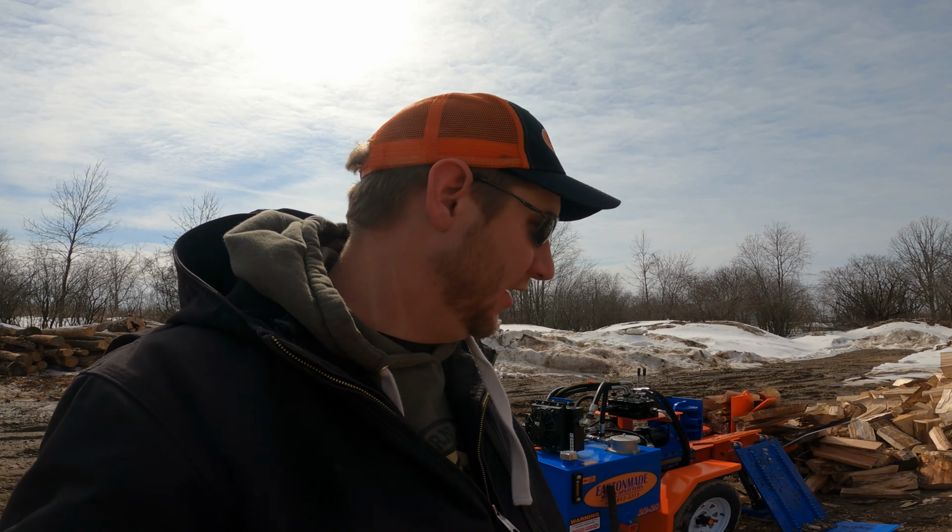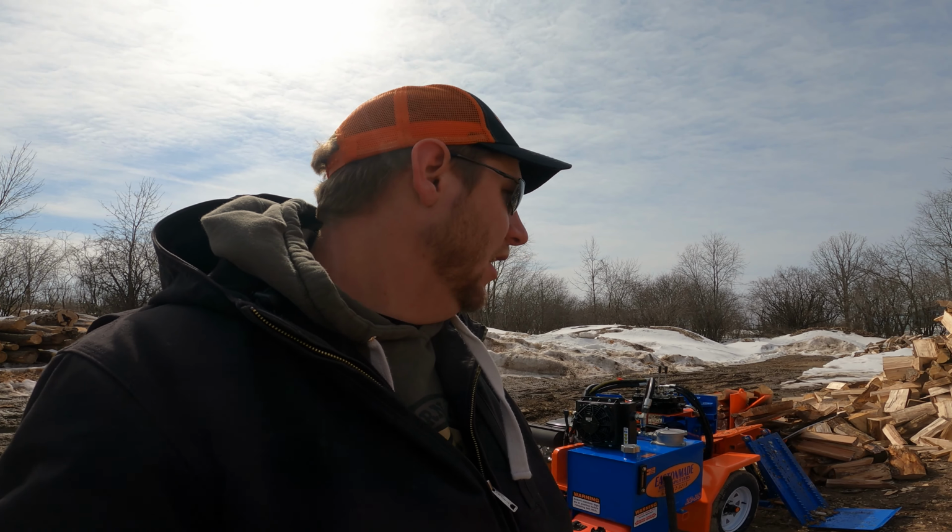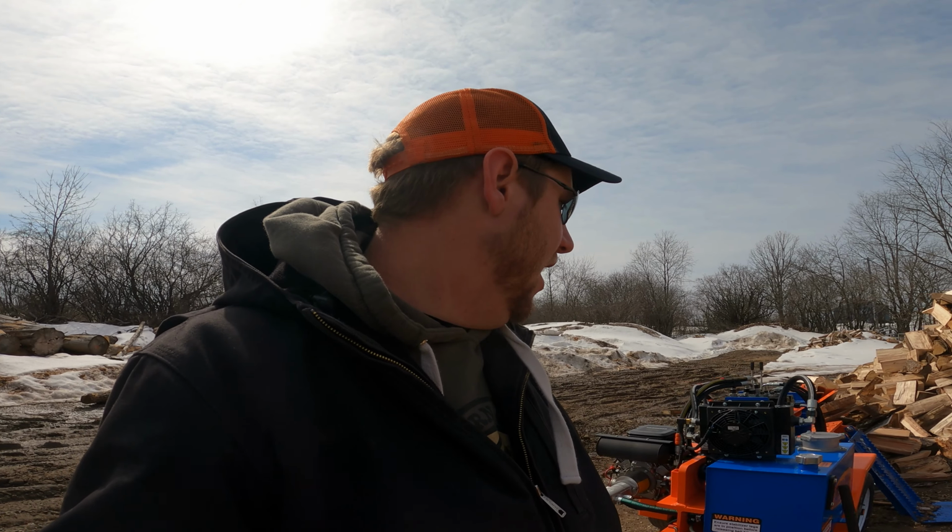Well, guys, as you can see, with those bigger rounds, it really makes life easy having that log lift. And like I said, the log lift's going to lift whatever you put on it. I probably wouldn't go much more than that 35, 36 mark. Can you? Of course you can. Is it a good idea? Well, again, it's a matter of personal safety, because if a piece of wood falls off that, you've got to be able to catch it. So just be well aware of that when you're running it.